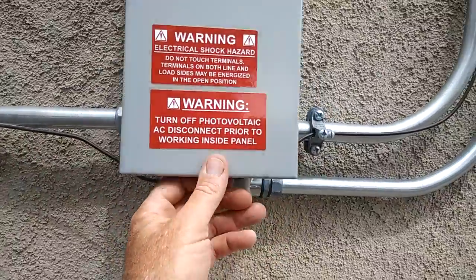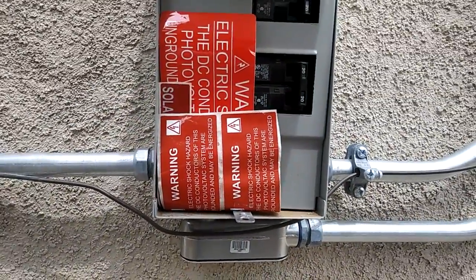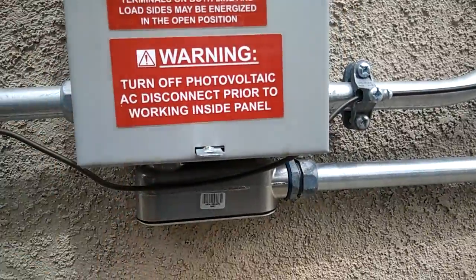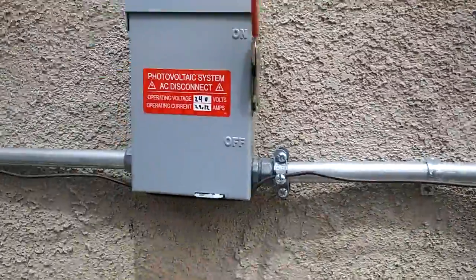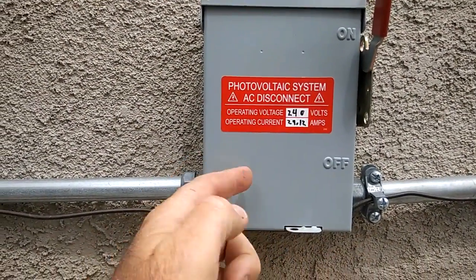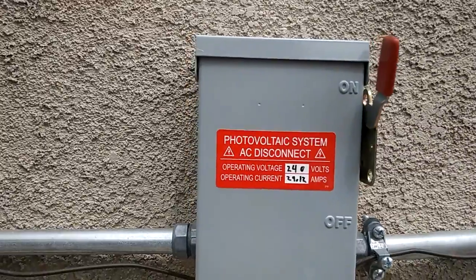They require me to put in two 20-amp breakers. All these labels were included with the kit, along with where to put them. I didn't put them up until the inspector came because I asked where he wanted them — it didn't quite match exactly what they had on their plans, but he said those are fine. Then you have to buy one of these disconnect boxes. Not a lot of electrical supply places have them — it has to have a handle on it for most codes. You can't just use a regular pull-out service disconnect; it has to be a switched disconnect, so they're a little harder to find.